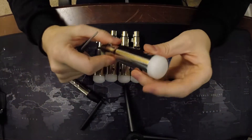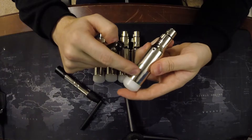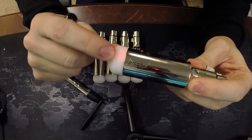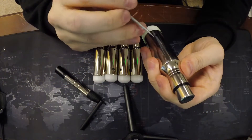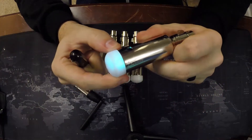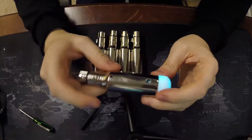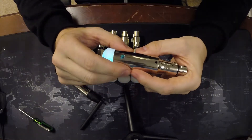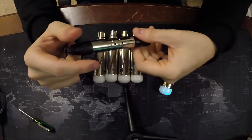For a little demonstration — I keep a small screwdriver in the kit because these buttons can't be pressed with a finger; you need something to poke in there. I'll turn this receiver on. You can see it's lit up red. I'll cycle through the channels: green, blue, purple, light blue. So this is completely self-contained. The light blue color indicates which channel it's on, and since it's not receiving any DMX from a transmitter, it just shows the channel color. Now I'll power up the transmitter and compare the colors.